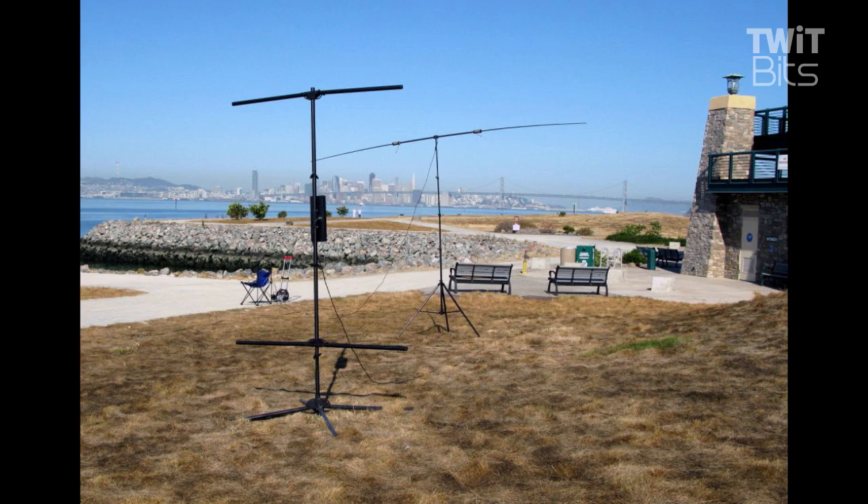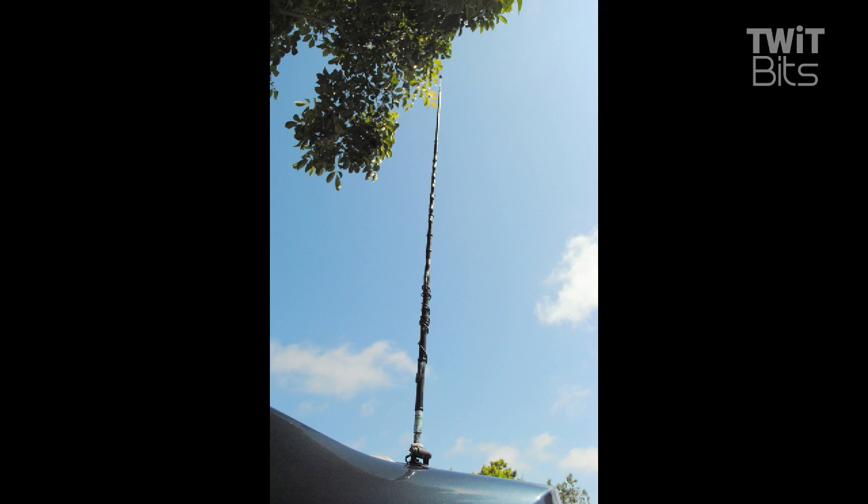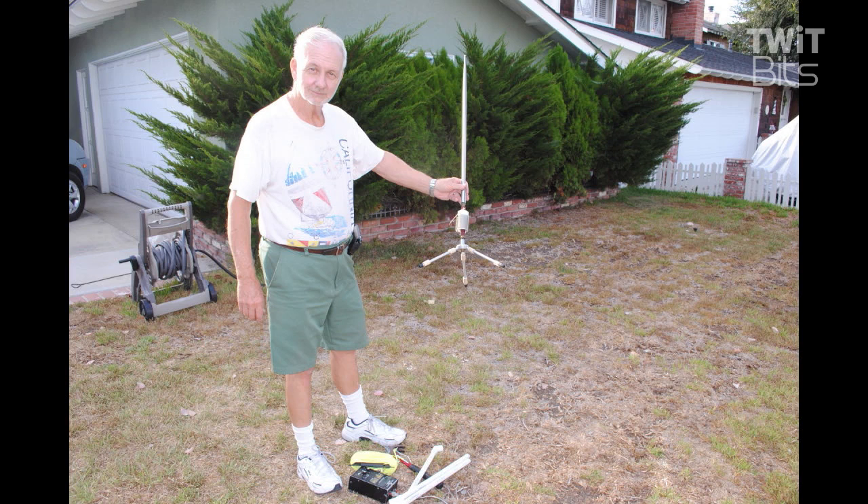Here's some open antennas — the buddy poles and some of the other TW antennas. Quite effective. They're not as strong as a regular dipole, but don't let anybody say you can't get a signal out if you have to have the antenna hidden. Look at this at Boxborough — here's a little loop antenna. Very high Q, and it does its job. Some areas here in Southern Cal will find that homeowners run coax out to their car because they're not allowed an antenna on the roof. And that works quite nicely. There's Ken, KB6EVR — he's run his Outbacker horizontal, counterpoised off of the metal railing. He just changes taps and he's back on the air.